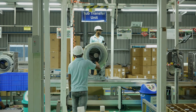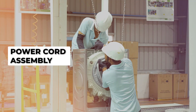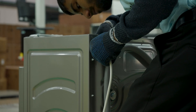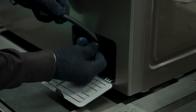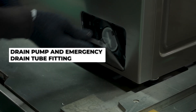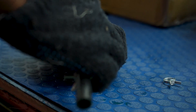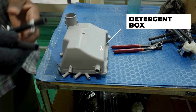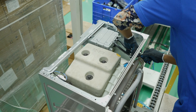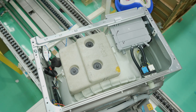The tub is now ready to be moved into the outer cabinet, along with some other additions like the internal power cord. The external power cord is also added before other parts are fitted. One of the most important components, the drain pump, is added to the washing machine — this is where dirty water will exit the machine. Meanwhile, multiple smaller individual parts come together to make the detergent box, which is then attached to the rest of the washing machine. The washing machine is almost put together and the drum and detergent box are all here.